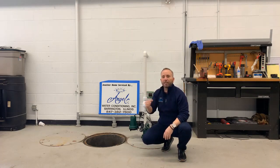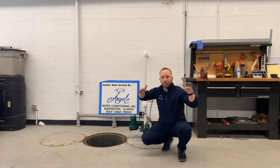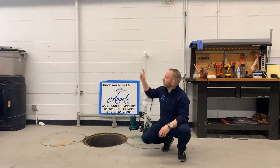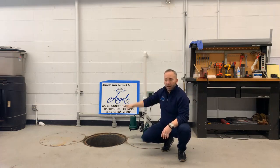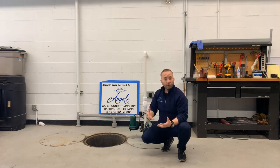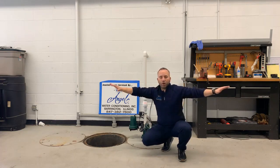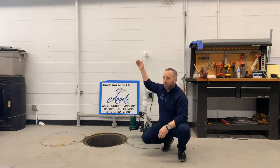The second reason we see a lot of basement floods is because people don't clean the gutters. You need to clean them several times throughout the year, especially in springtime. A good buddy of mine, Tom McCarthy, who owns Cornerstone Bank in Palatine, had a tremendous flood — something as simple as cleaning the gutters would have helped. Water came off the roof, flowed against the wall, and overflowed the sump pump pit. The pump had failed and there was no battery backup, so his basement flooded. Clean gutters ported away from the foundation keep water away from the home and don't divert it back down into the sump pump pit.